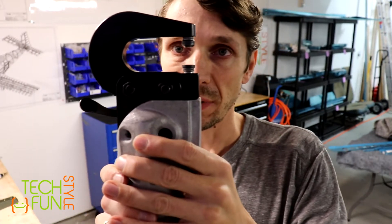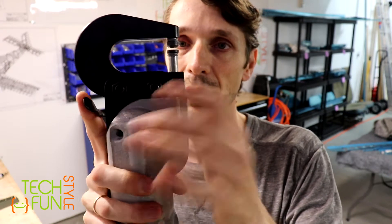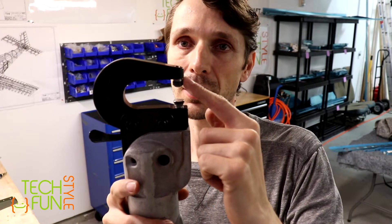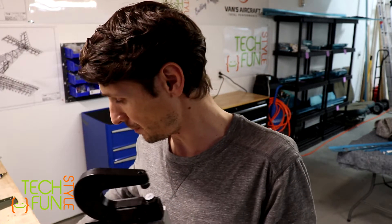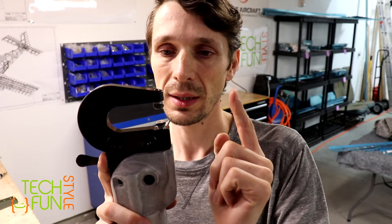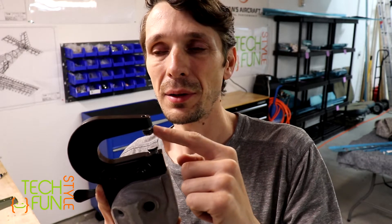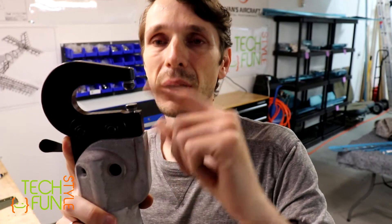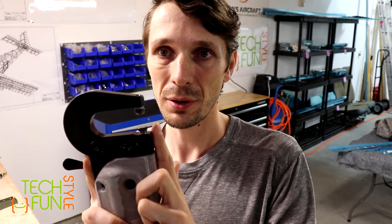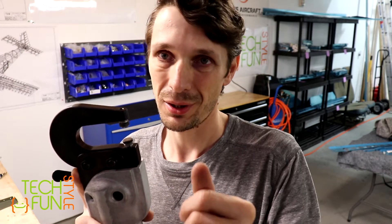Now, what are you doing with the pneumatic squeezer? The bottom part goes up, the top part stays in the same spot. You must push with the top part - the rivet into the part, into the rounded surface - while the bottom part will be squeezing. In my case, when I did my first rivet, I incorrectly placed the rounded part on the bottom in the opposite way. The part which goes out under high pressure must squeeze the actual rivet, not push it. In my case it went the opposite way, so I did a wrong riveting and had to drill it out. Now it's fixed.